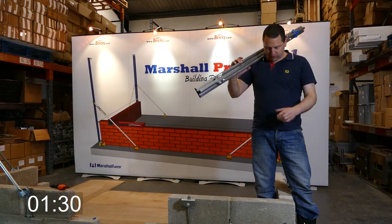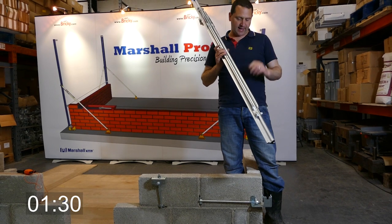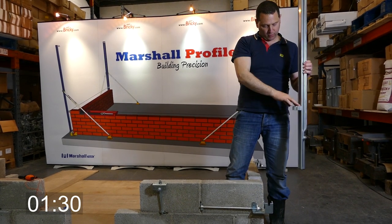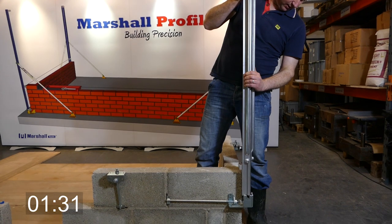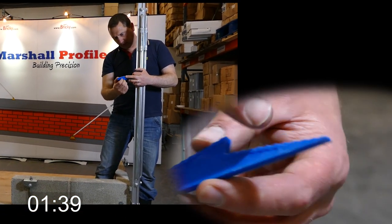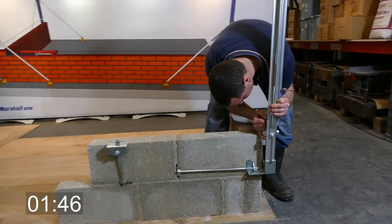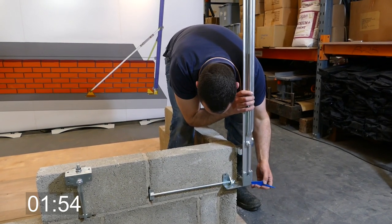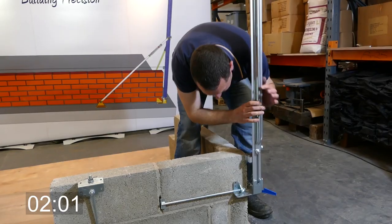The profile level checks on both vertical planes. All we need to do is set on our profile, set it for height, pull out our stair bars to stabilize it and get it vertically aligned. To set this for height, we'll bring our slider down to the appropriate height notch. I'll use what we call the height gauge to bring this to millimeter precision — it has one millimeter increments throughout it. The profile needs to come up, so I slot in the other end as far as it'll go, and the profile sets on that when I lock this in.